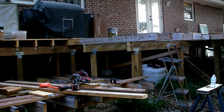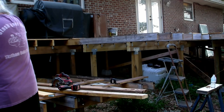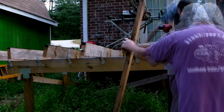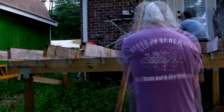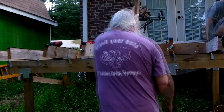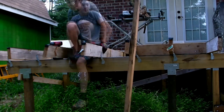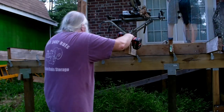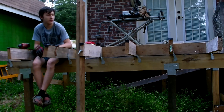Apparently we're working over on the other side here and all I've got is the camera pointing where I'm doing the cutting, which is not very helpful. I do get over here and adjust the camera. So we're getting these 14 and a half inch boards in — these are 16 inch on centers. When we take and pull the twist out, it pulls the screws through, it's so much twisted here. We just got to move on to get the next block in. He gets up there and gets the screws in. This one board still stayed a little bit twisted even after we got everything done, but it was way closer than it was originally. That thing had a bad twist in it.